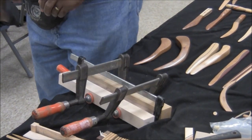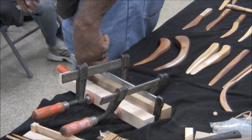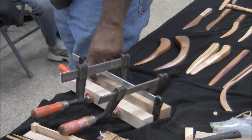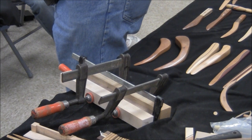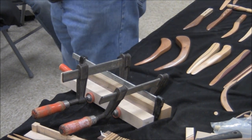How do you keep that centerpiece from sticking with the glue to the outside piece? All right, what I do to these pieces, normally I put some wax on them beforehand. Wax paper or wax? Well, I just put a little wax on the wood. And when I get through, if I want to use this wood again, I'll skim it on the saw, because the wax is only going to penetrate just a little bit. I imagine wax paper probably works. Well, wax paper is hard to deal with. I got enough stuff moving.